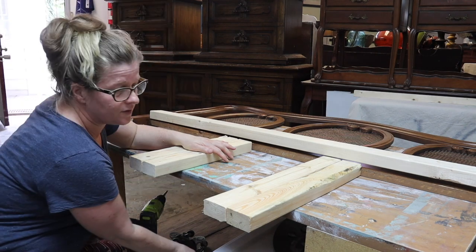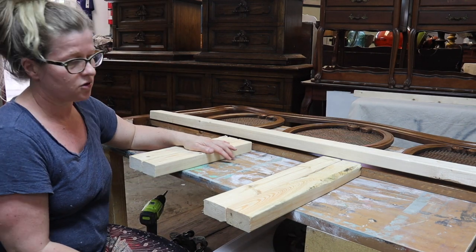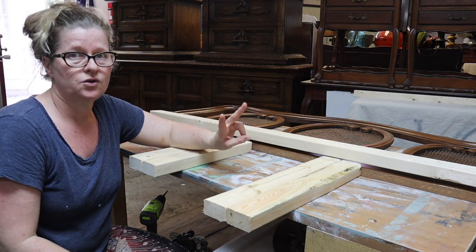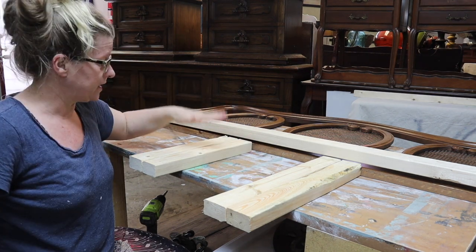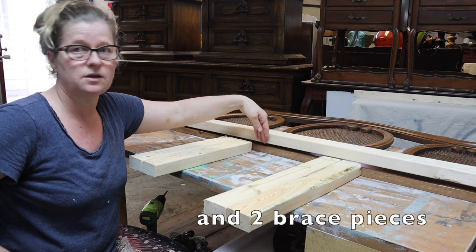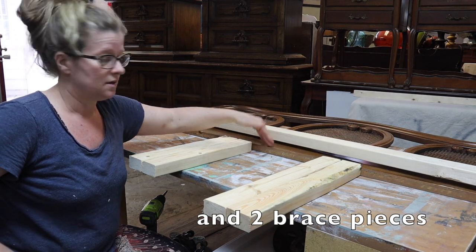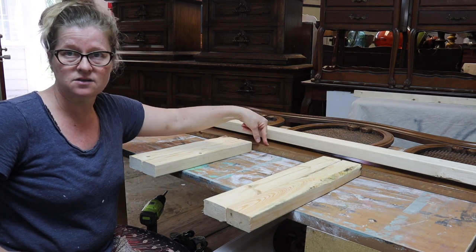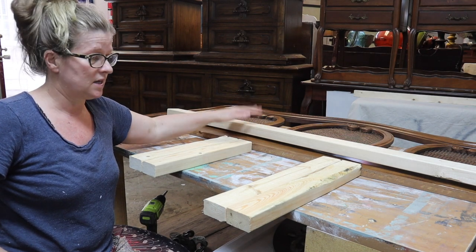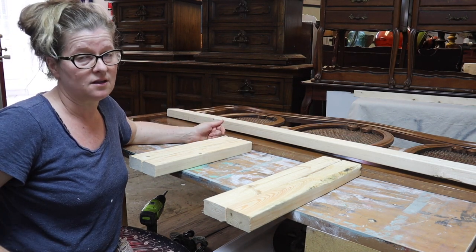Abandoned the side table legs, they weren't going to be strong enough. So I'm still using the two 2x3s that I had. I need two side pieces, two legs, and one front, because I'm going to be drilling it into the bedhead, because this is a solid piece of wood. If it wasn't solid, I would have to do a second one of these. I don't want to make the bench heavier than it needs to be,